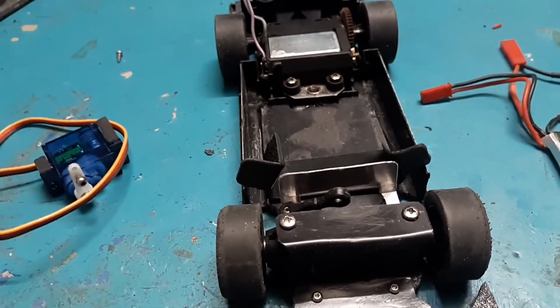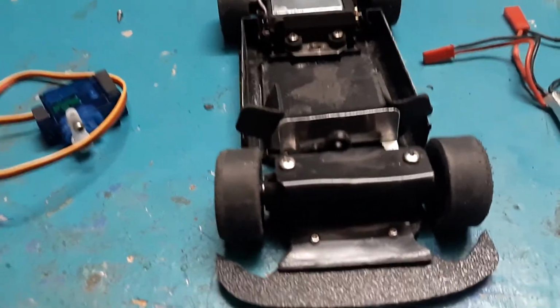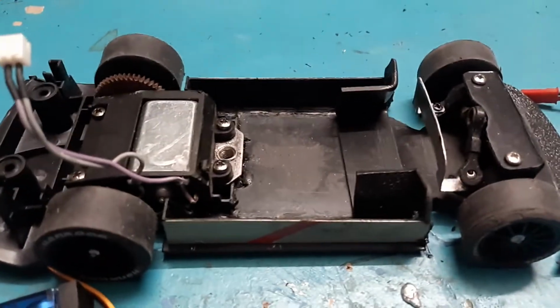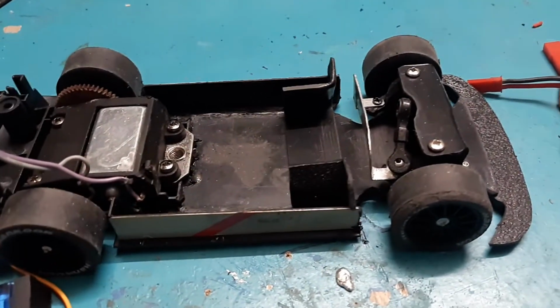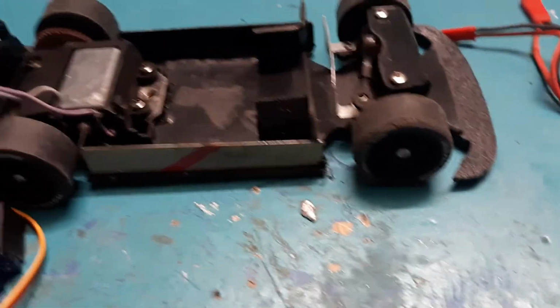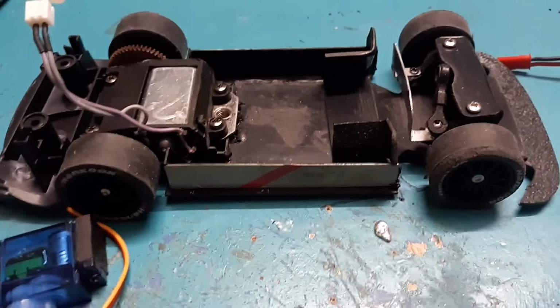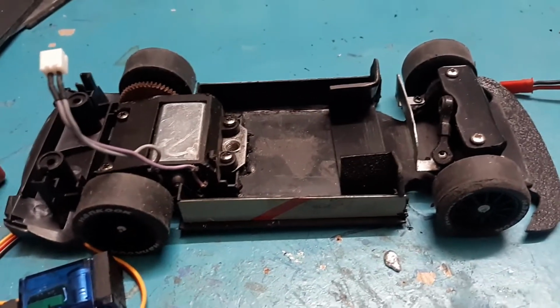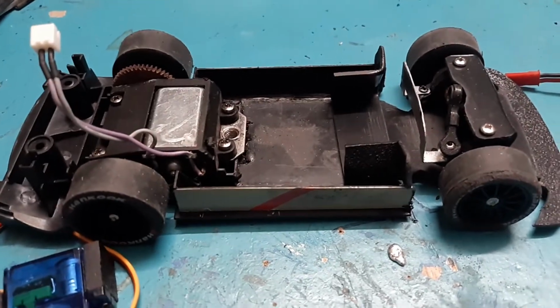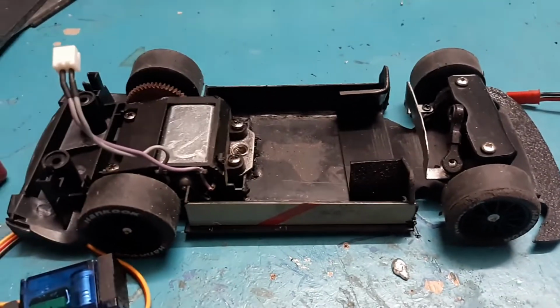You know, test fit it, cut it, make it out of cardboard if you have to. Because if you're making it out of aluminum, for example, maybe you have a limited supply of aluminum. Cardboard you can get out of a cereal box, Kleenex box, things of that nature, real easy. So I think this one's going to work pretty well. I hope that inspires somebody out there.